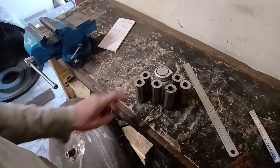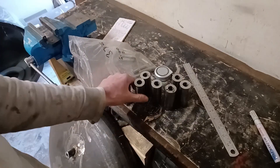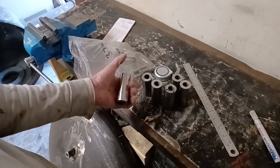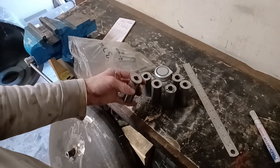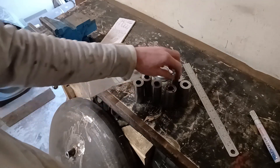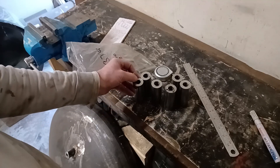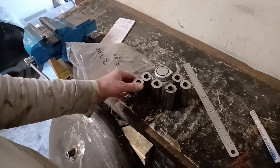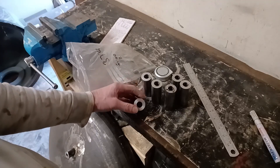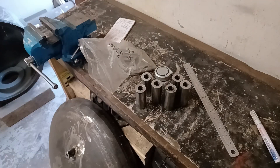I'm just going to start putting in a few more penetrators and things that need to go into the hull. I've stalled a little bit on these five-eighths through holes because these are drilled and reamed, they need facing obviously - they're now at the right dimension - but my o-ring grooving tool just isn't working, it's not cutting anything. I've ordered some new ones; it wouldn't even cut plastic, just rubbing. I honestly can't see what's wrong with it but there's something wrong with it.